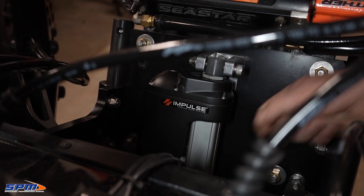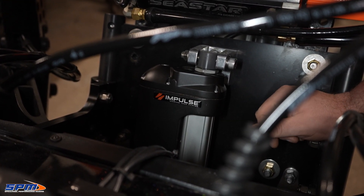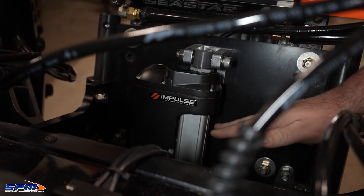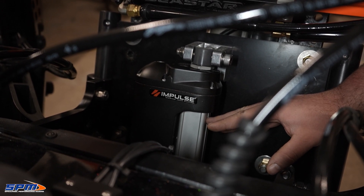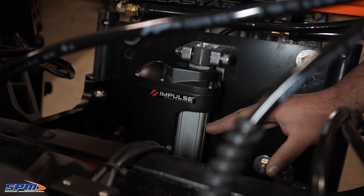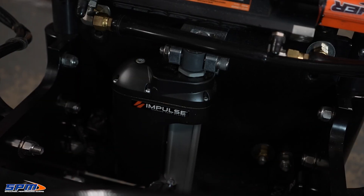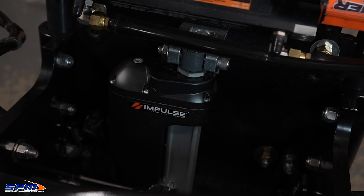Getting personal with the jackplate, this is the heart of the beast right here. This is an electronic motor. Most jackplates have a hydraulic pump in this place right here, and they either have the reservoir in the boat or on the hydraulic pump itself. What having this electronic motor does is it doesn't change its speed. You have a really consistent speed whether or not this thing is loaded or not loaded. It's very fast, very accurate. That's another thing that comes into play when we get into the smart control system.